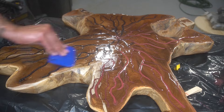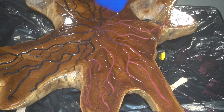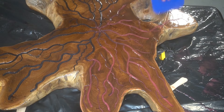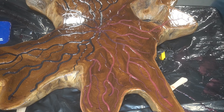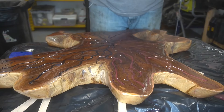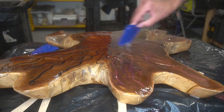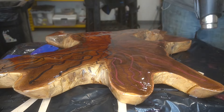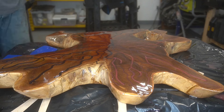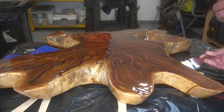The table is uneven so the epoxy sets up a little uneven, but I'll come back and fix that. We're just making sure that first layer of epoxy goes on pretty smooth — the black and pink doesn't look bad even if it's not the Texas Tech colors. I'm coming through with a heat gun to pop all the little bubbles, then we let that dry for about two days. After that we put on the final top layer, seal the edges, and brush the walls of the slab itself.